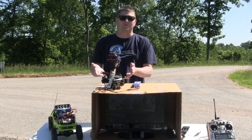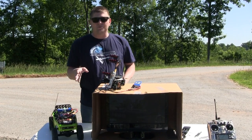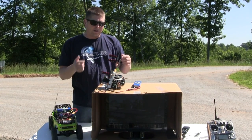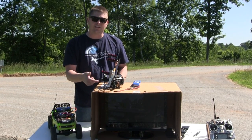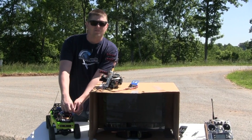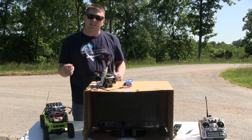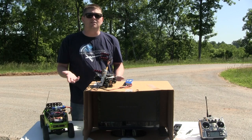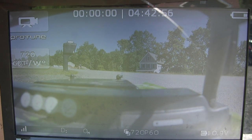We're all set up. Alex forgot a tripod so we had to do a makeshift mount with his Trident tri-copter. One of the first things we noticed as we were getting set up: we fired the ground station up first and noticed no blue screen — the Connex receiver is still transmitting a signal directly to the TV even though the TV would normally go blue screen with no signal. So I'm going to unplug it so you can see. The screen still has some sort of signal, which gives us hope that even when we start having signal loss and breakups we won't get a blue screen — we'll still have some image to use and continue to drive the vehicle.